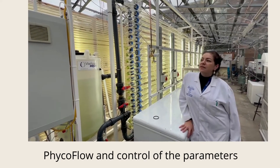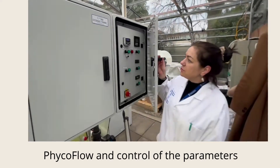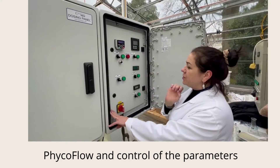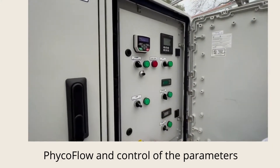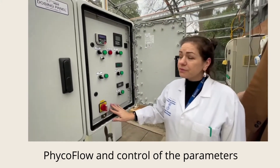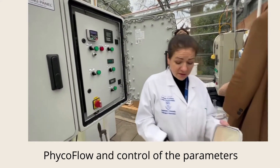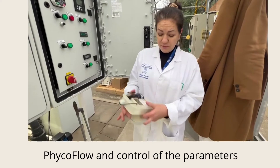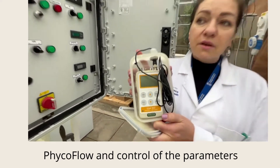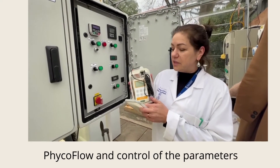This reactor has a control panel where we can monitor pump movement, pH, and also the supply of CO2 and temperature. Additionally, for the abiotic conditions, we measure light with universal light meters, because it is important for the efficient photosynthesis activity in culture.